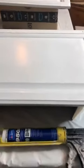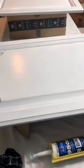And you guys, that's all there is to caulking. And then anything that's up over the edges, the paint will cover that. But you can go a step further. You can take your rag and wipe it off, because all you want is down in that groove, really. But anything that's gone up out of the groove is fine, because you got paintable caulking. Okay, it's that simple, you guys. People are so afraid of the caulking, and I have seen contractors do the worst caulking jobs, and there's no reason for it. There is absolutely no reason for it.